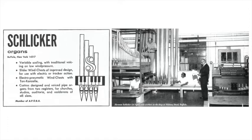Okay. So now we can see if it plays on the voicing table. It has a chest and keyboard. The pipe is speaking a little bit fast. In other words, it wants to blow its octave, so we have to slow it up. I went a little bit too far, so I have to give it one tap back the other way. It's rare that you make one adjustment and put the pipe on the table and it speaks the way you want it to.